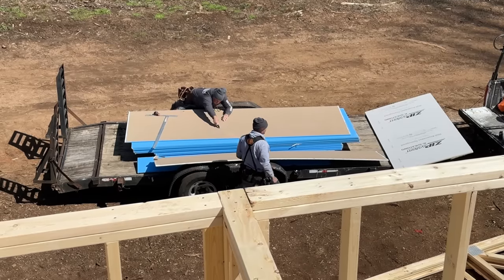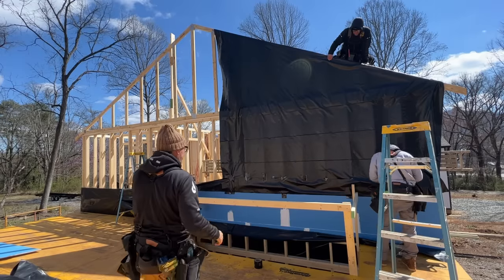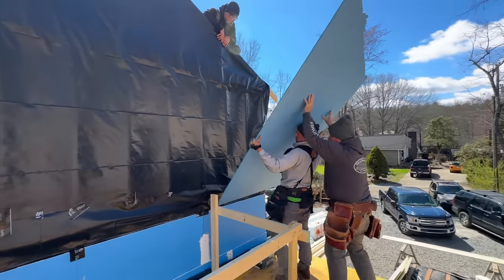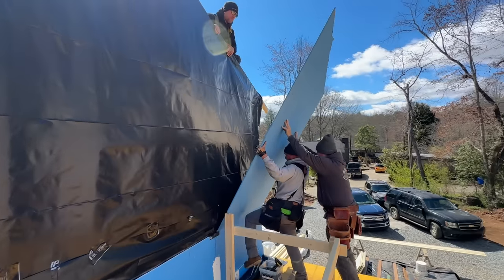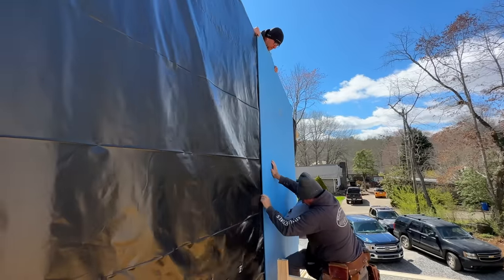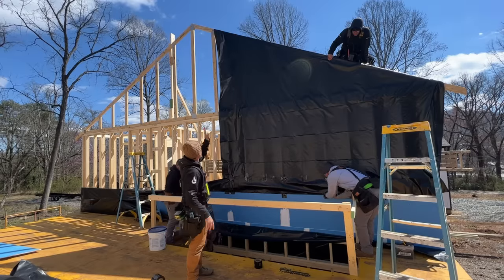I think they're gonna go and cut the angle on it. We've got our plastic up and we've got it lapped in such a way that hopefully water won't run in. Arlo's devised this whole method. Now we're gonna stack this first layer of drywall again and a second layer and encapsulate the whole thing all the way up.